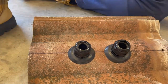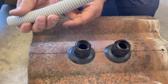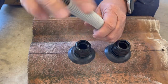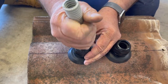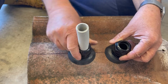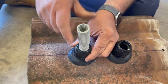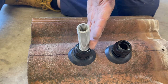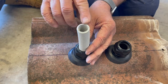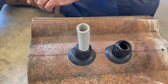Just a little demonstration while we're at it — when it comes to actually putting some cable through, the ideal way to do that is to use 25mm corrugated conduit, which is of course flexible. We just push that in and you can see it's a nice tight fit, and once we tighten that up even just hand tight, it is so tight it's not going to come out and it's certainly not going to leak. That conduit can of course be any length, and my conduit normally does a 180-degree turn so the other end of the conduit is pointing down, meaning water physically cannot run in — it's not possible for water to get in. Thank you for watching.